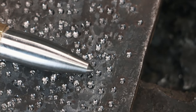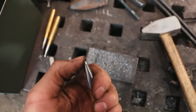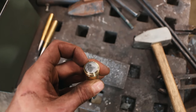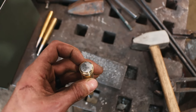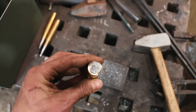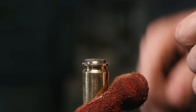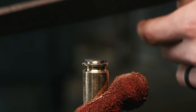This end is like, for a center punch, you're still good to use it. There's a very marginal rolled tip, but it's not bad. This end is actually looking pretty good — it has mushroomed and rounded off. There's no splitting or anything at this point. For me in this shop, I thought like a thousand center punch marks for holes — that's a lot of holes for me. I guess it depends on where you're at and what you're doing. I'm going to try to fiddle around with this — I want to see if you could just come in with a file and adjust that. I wouldn't be fixing it at this point, it's not that bad, but I want to see what's going to happen here.